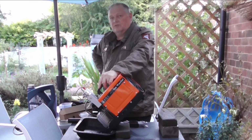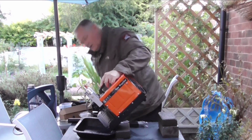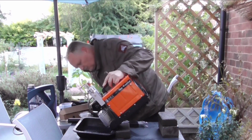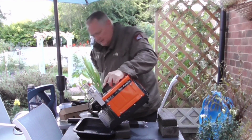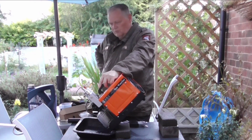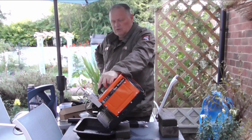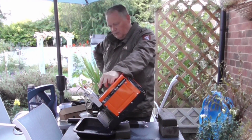It did blow at about 295 bar, but luckily enough it comes with about 3 blast caps anyway. Just stops it going over and exploding. But still coming out. Looks pretty clear. There's no metal filings in it or anything like that, so not a problem. It also comes with a complete seal kit as well, so you can service it by taking the top off and everything.